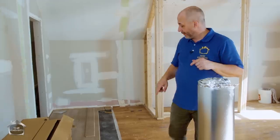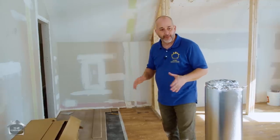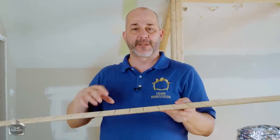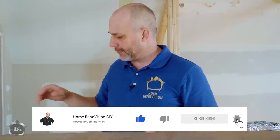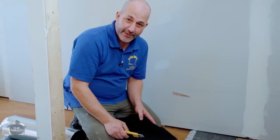This type of hardwood doesn't have the same expansion and contraction rate as typical hardwood. Because of the kerfs cut into the bottom, it doesn't grow dramatically in humid climates — if you have basic heating and air conditioning, a quarter-inch gap is plenty. This performs closer to vinyl on the scale, and better than traditional MDF laminate, so don't be too concerned about leaving massive gaps or using lots of shims.